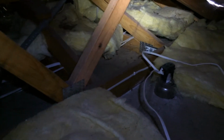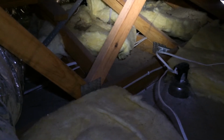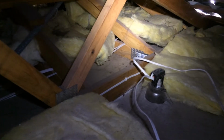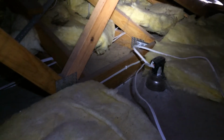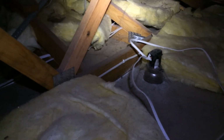And the cellulose fibre that I just showed you, doesn't it look a lot neater than this looks? Even around the downlights, the cellulose looks a lot neater and a lot tidier. And you don't have anywhere near the gaps, and the job's done right, and you don't have any problems with rats or mice building nests underneath all these little hollows and everything that are up here underneath these bats. And the borax in the cellulose will kill any of the bugs, and it's actually more fire retardant than any of these products.